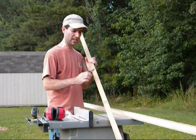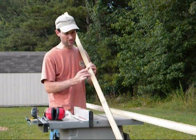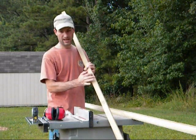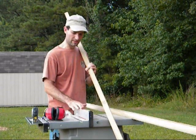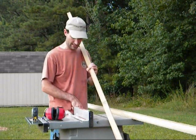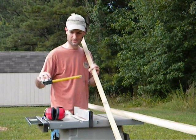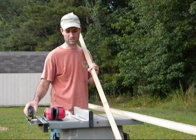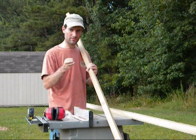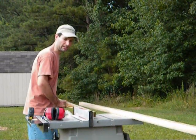What I'm going to do now is cut a channel to place the solar panel. From each end, I am going to make a cut of 3/8 inch on each side and 5/8 of an inch deep. I have the rip fence on the table saw set at 3/8 inch from the blade, and I have the blade set to 5/8 inch deep — that's how deep I have the window seal for the solar panel. I'm going to make one cut along that way.